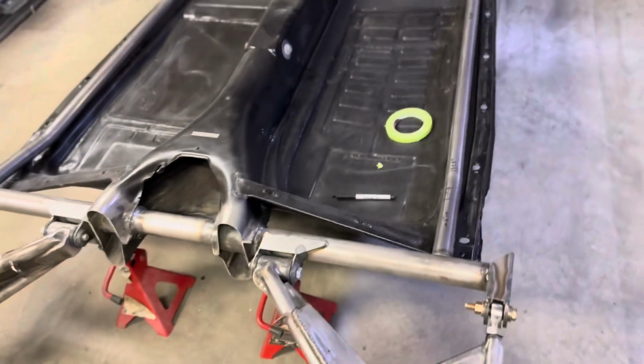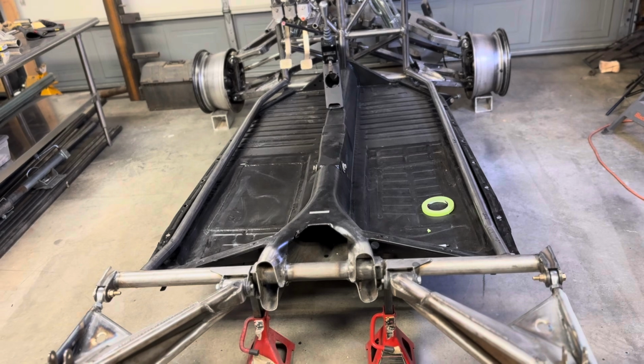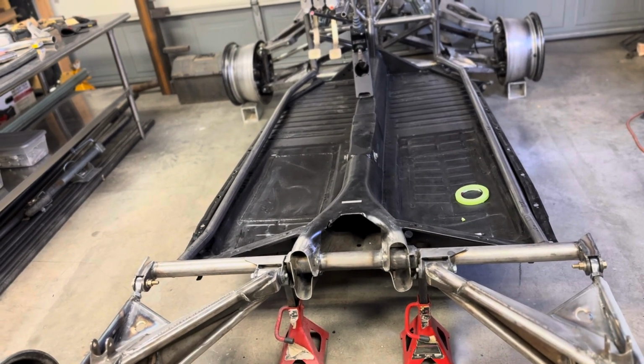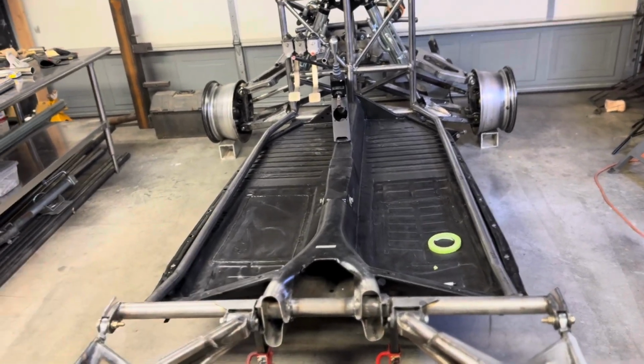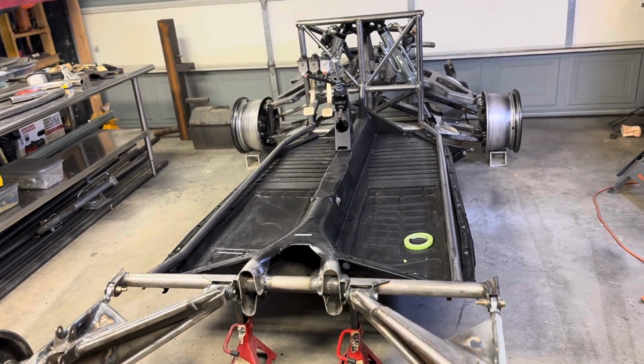Then I'm going to go outside, and I'm going to cut the entire rear section out of the back of the Bug. That will just give me access to everything I need to get to for adding all my structure, my tubing, my engine, transmission, shifter linkage, everything will be accessible. And then before I start driving, I'll try to seal it up as best I can with some aluminum or sheet metal, carbon fiber sheet, something.